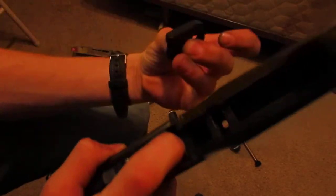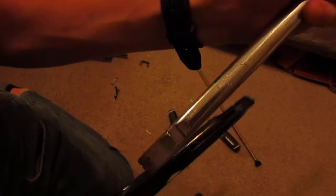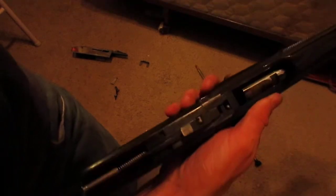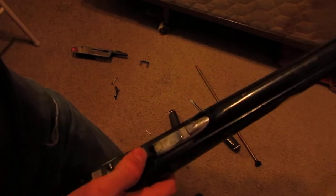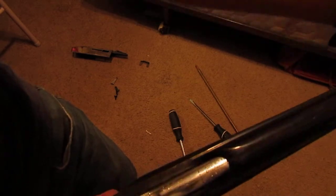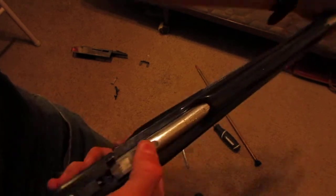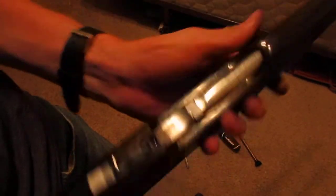That goes down into that little groove there — see that groove? It's fit just for this. You can see that little screw hole in the bottom where I pulled that retention screw out earlier. It's going to sit in there, and I'll let it hang there for a second while I get my barrel through it. There's a little dado groove there where that retention pin holds it. I'll take that and run the barrel through there. It should pop into place — real tight. That's exactly where I want it, that's exactly how it's machined.